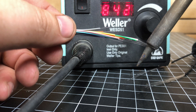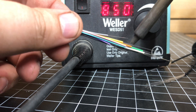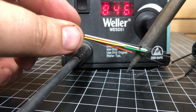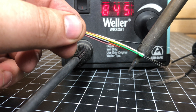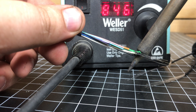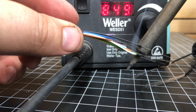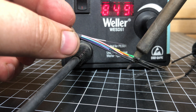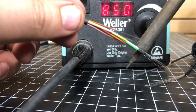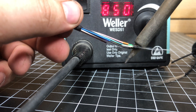Going back to the second reason I thought using glass might be helpful in certain situations — like around lots of heat. When I use plastic fibers, I tend to reach my breaking point pretty quickly, and sometimes I even give up when I melt the fibers for the second or third time. If I was better at planning or had more patience, I'm sure this wouldn't be the case. But with these glass fibers, I can use all the heat I want and they stay intact. You can actually see here the insulation is frying away way before the fibers have any issues — they're still good.